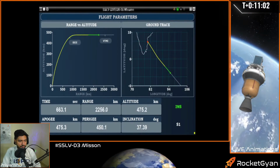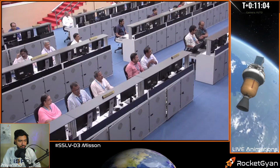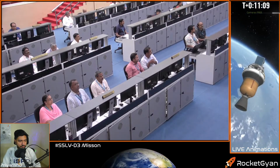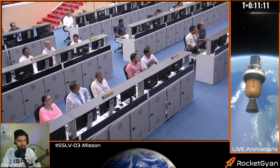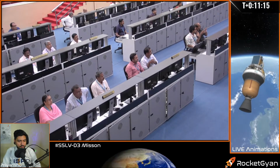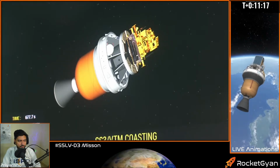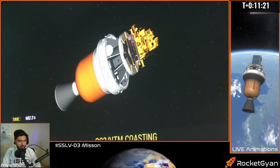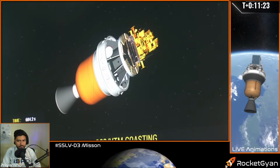RFS package consists of LNAs, S-band and X-band filters, switches and solid-state power amplifier. Micro dual gimbal antenna, flexible solar panel, pyrolytic graphite sheet diffuser plate and miniaturized phased array antenna are among the noteworthy new technologies.